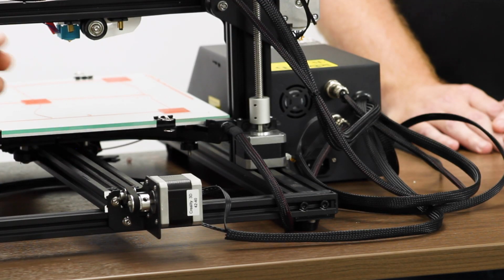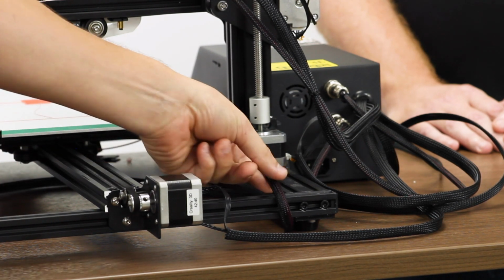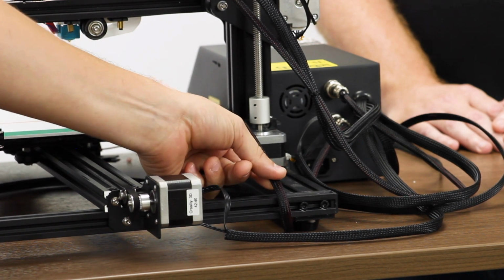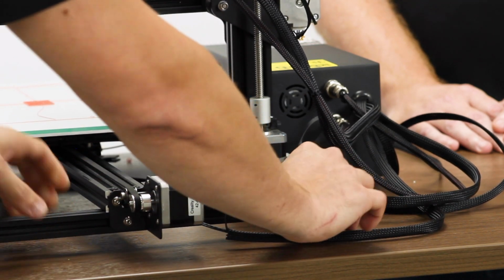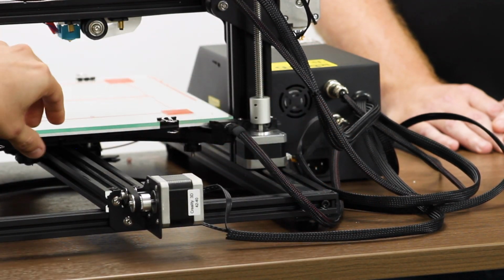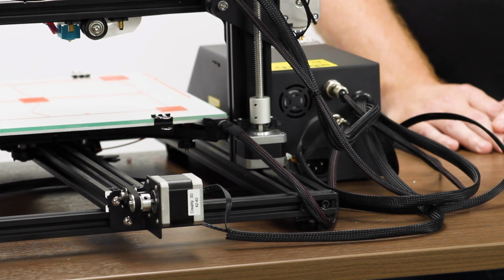And at the very least, it's going to introduce artifacts into your print, because that y-axis movement is not smooth. You're going to have kind of the vibrations from this rubbing against the back corner. More typically, it's just kind of caught around the corner like this, and it can move a little bit further, but there's still going to be issues of sorts, at the very least artifacts.